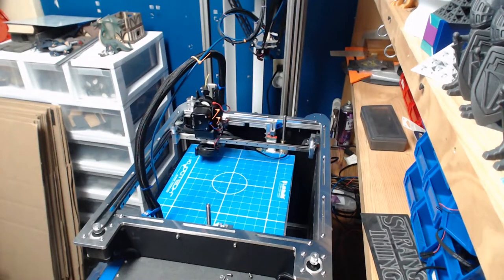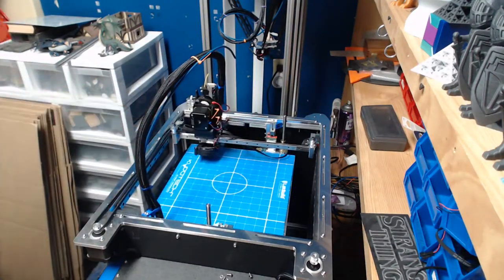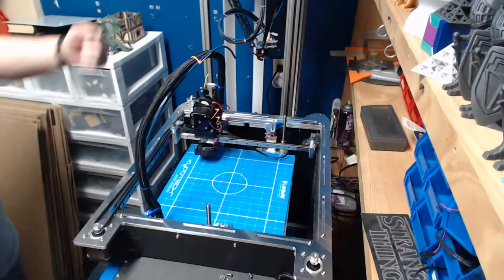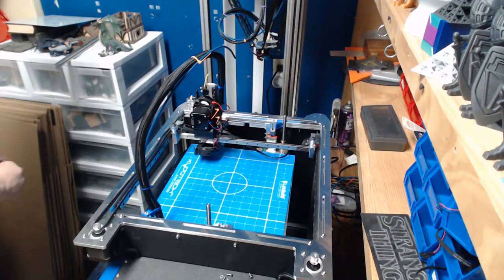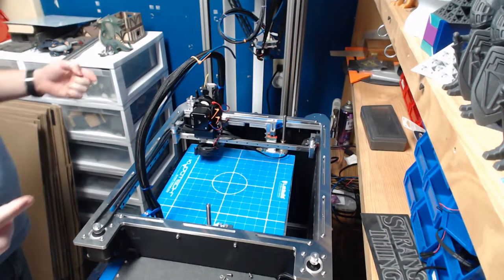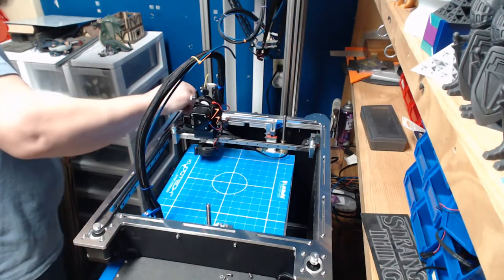You can solve that. But then your next challenge is that the Y rail will deflect about the same amount, about 2/10 of a millimeter, if you extend it far enough to go for a 500 millimeter printable span. So that's part two. The next problem you would run into is the belt path being longer. You can get more vibration, and it takes a lot of belt tension when you go that big. So you want bigger belts. You want the 9 millimeter. They take more tension, and your shoulder bolts are going to hold a lot of tension, probably past what a 5 millimeter shoulder bolt is rated at. So to scale it bigger is not a trivial, oh, just make it bigger. You have to solve each of those problems one by one to do it right.